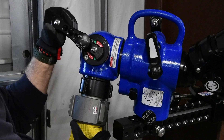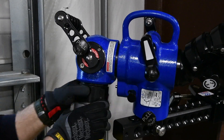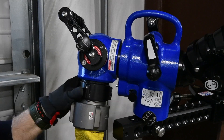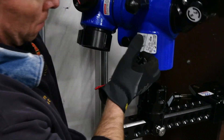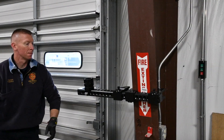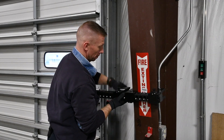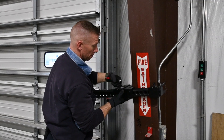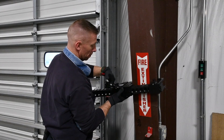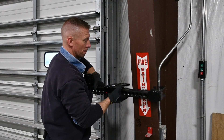To break down the Hemisphere monitor, stop flowing water by moving the valve handle away from the supply hose until it locks into place. Next, remove the supply hose. Pull the monitor release knob and lift up on the monitor. Turn the crank arm counterclockwise to release pressure on the movable clamp jaw. Next, pull the cross-pin, slide the clamp jaw away from the I-beam flange, and remove the assembly.